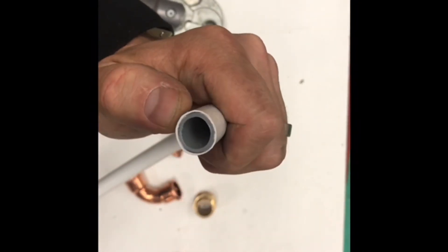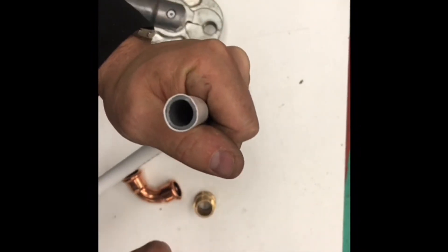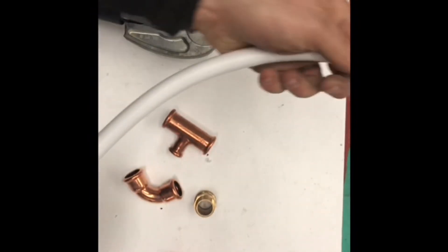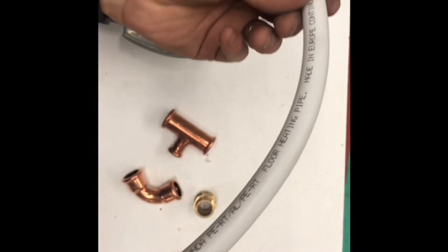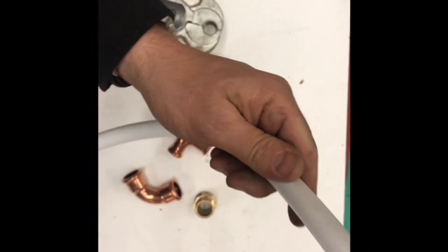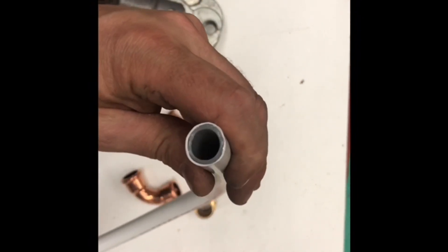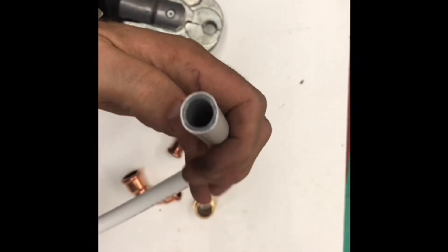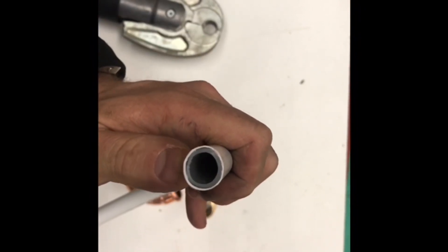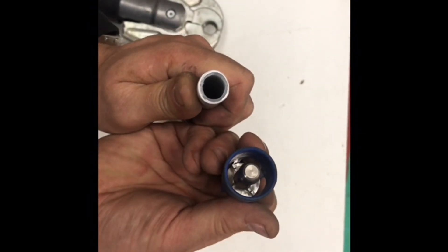Oxygen can't get through it or out of it. Different process now — you're going to seal the fitting on the inside of the pipe, so you're not bothered about the state of the outside of the pipe. If it's scratched or a bit dirty, it's not a problem. With push fit pipe you've got a major issue if it's got a big scratch in it, because the O-ring has to fill the gap once you fill it up with water.